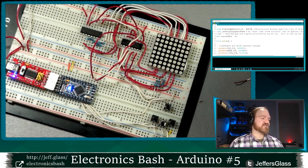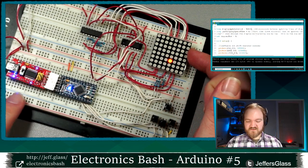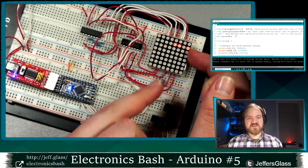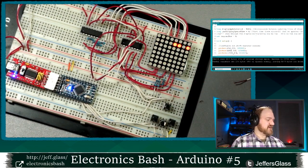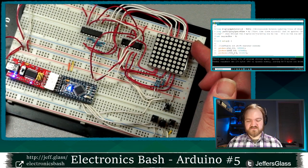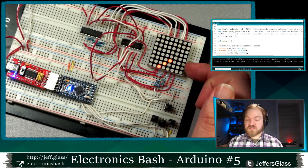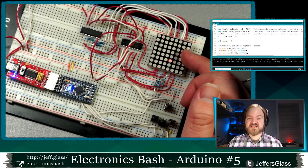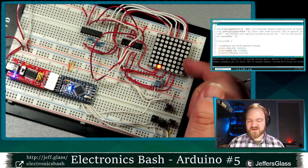I'm gonna knock a zero off that, and we'll do this every 50 milliseconds. Uploading, booting, better, right? Getting a little bit closer. Let's knock that down to 5 milliseconds. Uploading. Booting. Close, right? We're sort of seeing the whole image, but it's still flickering. And so I'm going to end up back at my original 500 microseconds for my update time.